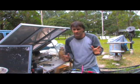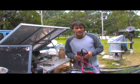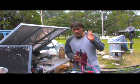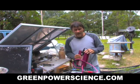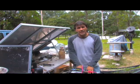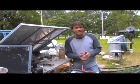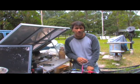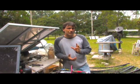I've got this additional panel hooked up — you can attach multiple systems to your batteries and they're good to go. My inverter is hooked up and I have an extension cord that runs compact fluorescent lights throughout the day, which basically just supplements our electric bill. You can tie these directly into your electrical panel — I do recommend a skilled electrician to do that, because it can be a little complicated. One thing to keep in mind: if you hook up an inverter that's not super powerful, never plug in a 10 amp vacuum or a hair dryer — this inverter simply won't handle that. All inverters have a power cutoff; if you overload them they shut down, and if battery level drops too low they'll shut down as well.